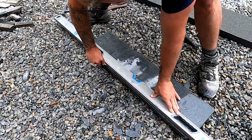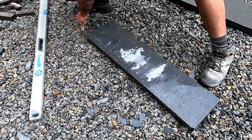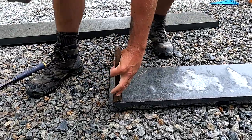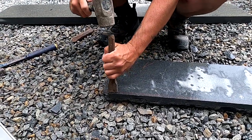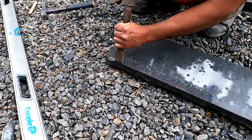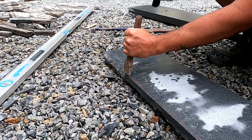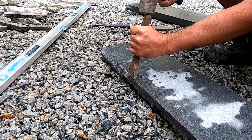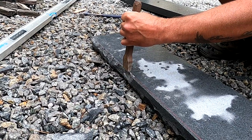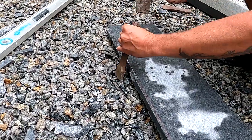But I just wanted to go through completely this piece that I've been rock facing. You guys have seen me do it from beginning to where we are now. We got it flipped over, and when we're on the other side, this is where you have a lot more of a chance to really break something, because the other side has been done. For some reason, it makes it easier for it to break at a bad angle. Not quite sure why, but you want to be a little bit more easy on this one, and you want to have your chisel tilted back a little bit more when you go on to the bottom side, or the opposite side from where you started.